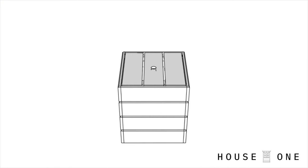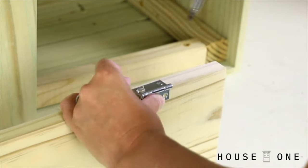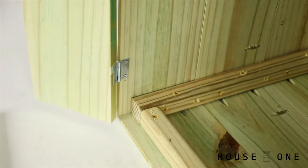It's now time to work on the top of the table, which sets inside the frame. It doesn't fit perfectly — there is some room allotted for gaps so that when the boards open, they don't bind, and also to allow room for the hinges at the front and back of the table. To install the outer pieces of the lid, attach two hinges to the edge of each board, and then attach it inside the assembled table.